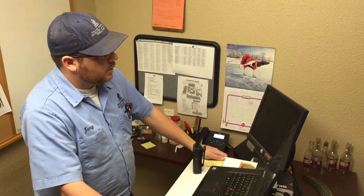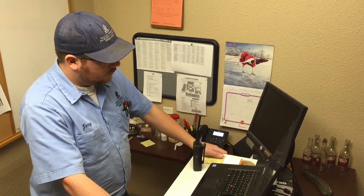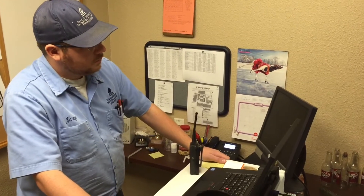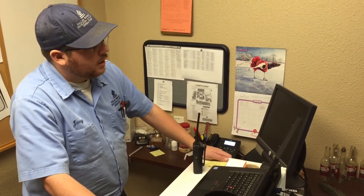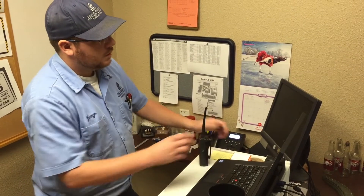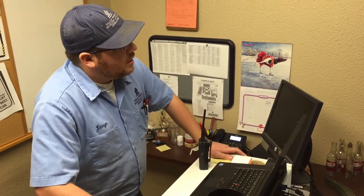The main thing is that we just make sure that it's locked out and it will not turn back on. It cannot be energized again. We really want to make sure all the energy has been dissipated — hydraulics are out. We have released all the energy and deactivated it all. We want to make sure all the switches are off and in their locked position so no one can get a hold of it. That way we have it locked out and ready.